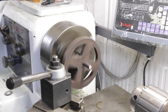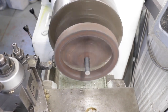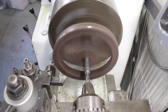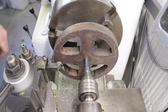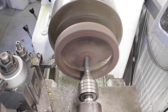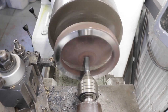Over on the lathe I'm going to be trying to make this piece round again — you can see from just how out of round it looks that it definitely needed some work. The oxide that builds up when you plasma cut something can be really hard, so I was immediately having trouble cutting it. I used a center drill to drill a hole in the end of my rod and then put a live center there just to keep it a little more rigid. I'm using an indexable carbide cutter and taking light cuts because this is what's called an interrupted cut — and you can see and hear it just chattering away.